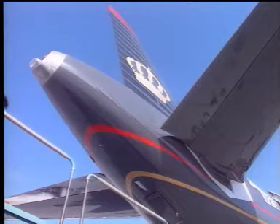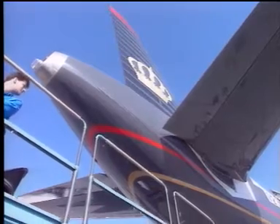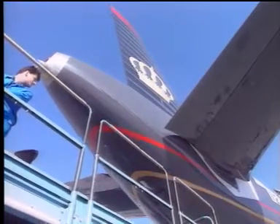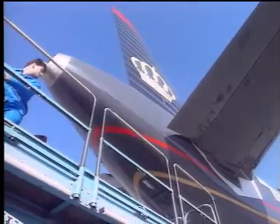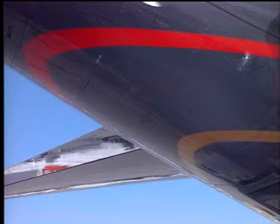In the cockpit, open the APU circuit breakers. Position a work stand suitable to reach the aircraft under the APU compartment. The APU doors are secured by a total of seven latches: five latches secure the left door and two latches secure the right door.